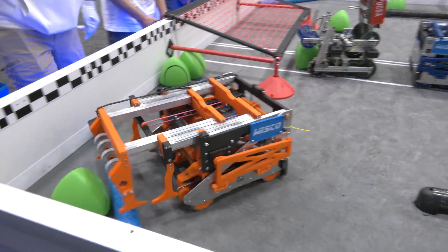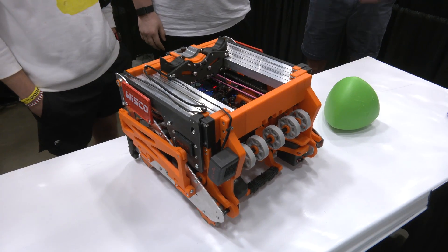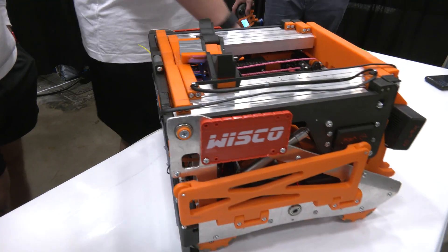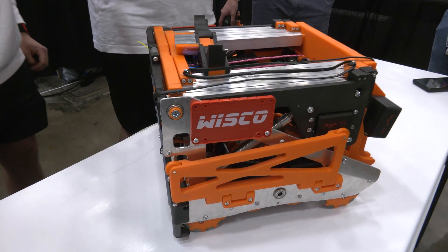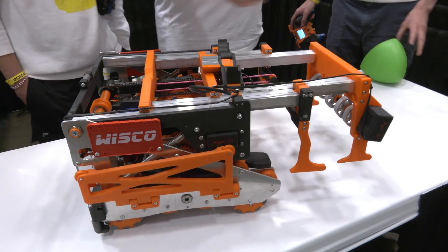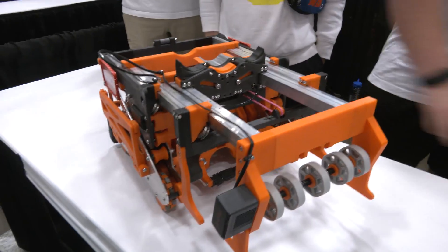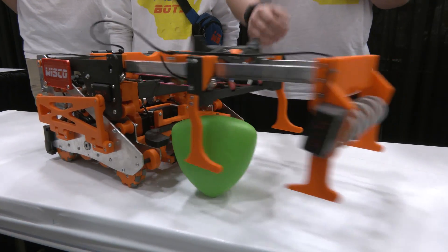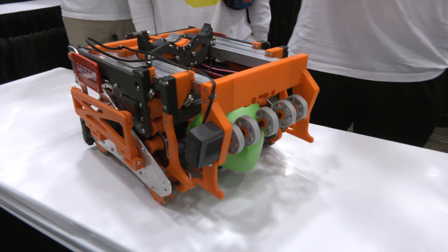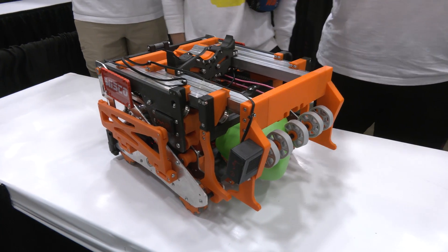I love linear slides on robots — they look cool and you can do great things with tri-ball control. The elevator is mounted in the back corners with bearings on the drive plates. The drive plates run all the way from the front of the rod up to the corner, giving us a nice, strong triangle. When Henry actuates the elevator out, it allows us to go over the middle pole and over the load zone pole. Then when Henry drives forward, these elevator walls keep the tri-ball in the tunnel so we can grab a ball and it won't leave the area underneath the elevator.